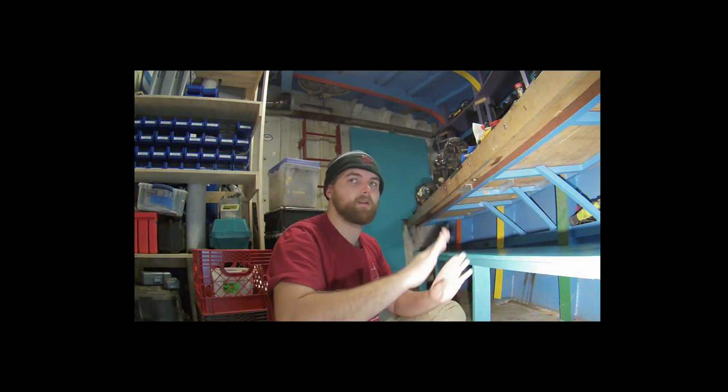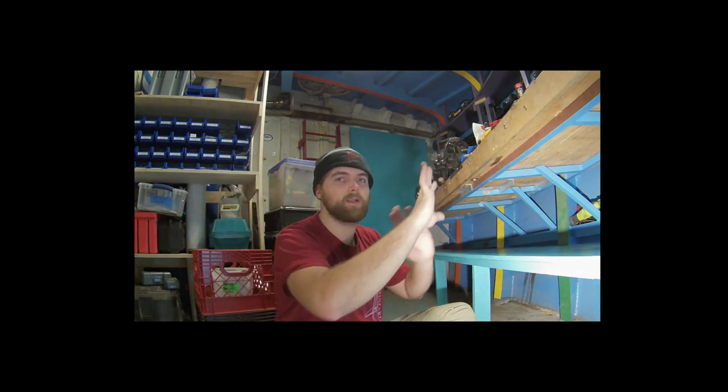Rollers — go in a W shape so you get all over the place, because they leave such terrible marks when you're done. If you don't have this crazy random pattern, everyone's going to go, 'Oh, you roller brushed it.'